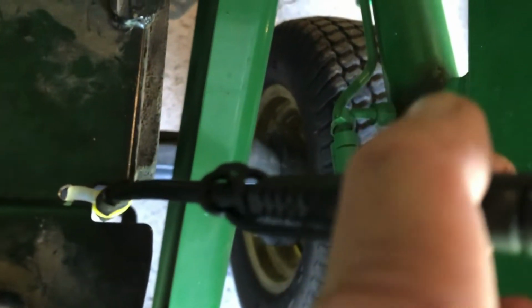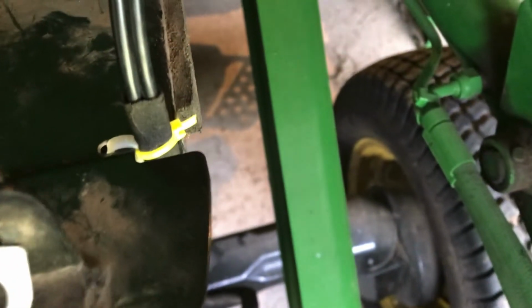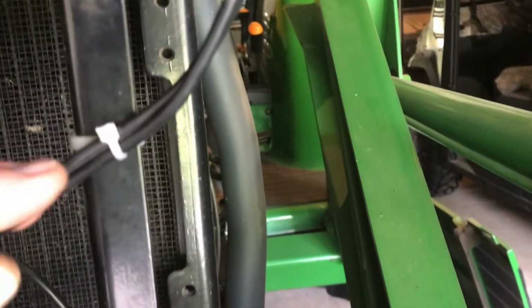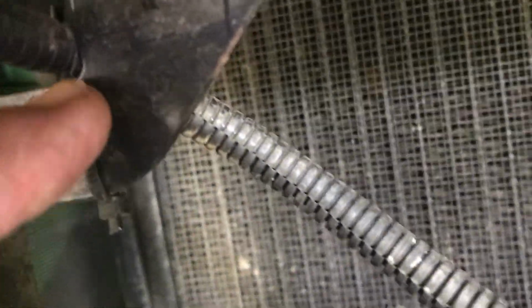So we have the part. I redid this a little bit. But you can see there's a standoff. I have abrasion tape wrapped around it and it's tucked in there. Does need to get out of the way because a plastic part is gonna have to fit in there, so we'll find out if that works. Got a tie off right here, standoff. I tied it to the convolute here to keep the vibration down. You can see I've got a standoff right here, another double loop.